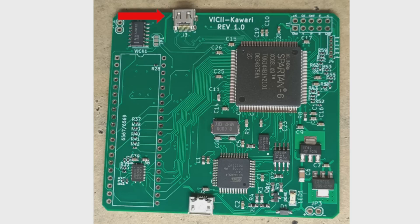Let's take a quick tour of the board. There's a micro HDMI connector at the top. DVI is generated directly from the FPGA now, so there's no need for that HDMI adapter I was using before. There's also a header on the right for analog RGB for a VGA connection, and that header should also support analog RGB for something like a 1084 monitor, although I haven't tried that out yet.